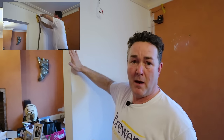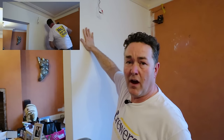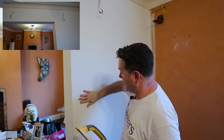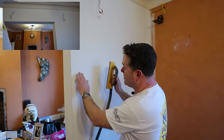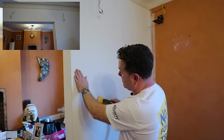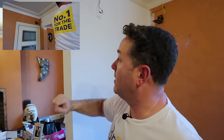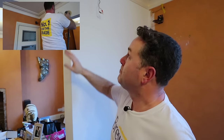I'm going around the corners, the angles, the flats, into the angles with the 120, and finishing off with the 180 on the proper Mirka sander, sucking the dust as it goes. I'm not looking at heavy sanding — just running my hand over it. Anything I feel that's a slight trowel mark, it feels smooth — just some trail marks — literally go over like that, easy as that, it's gone. It sands down ever so easily. As a product I'm really impressed: it rolled on nicely, floated out nicely with the smoother, and now it's dry it just needs a light sand for any slight imperfections.